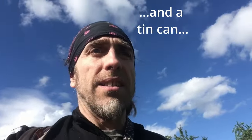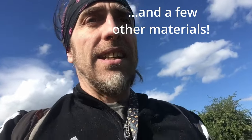So there we go, a very cheap and simple contact microphone, a bit of a lo-fi monster. It's a very simple build, the parts are readily available and cheap. It only requires a piezo contact mic and a quarter inch mono jack plug, a bit of soldering. And you can actually buy the piezo contact mics with an output jack already soldered on. So if you don't have that equipment, you could go that route.